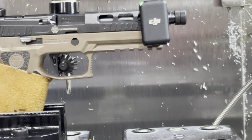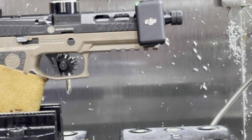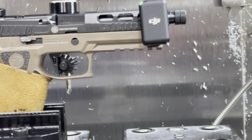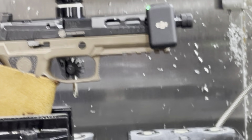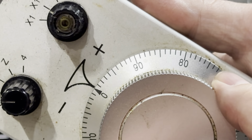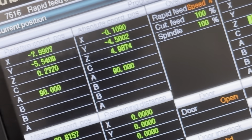There it went. So we're two millimeters into the trigger pull. Now this time I'm going to go to where the gun actually fires. We know it doesn't fire — I should be able to go minus 90 with no issue. Minus 90, the gun did not fire. I'm just going to keep cranking it one thousandth at a time. There it went. Let's see what our number is — 109.